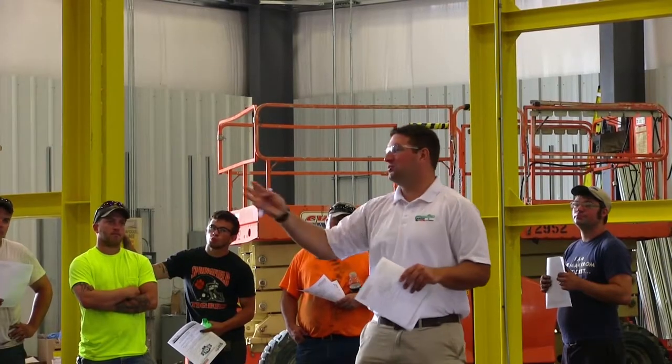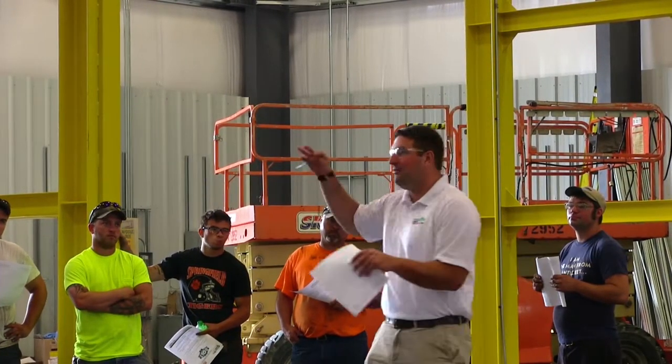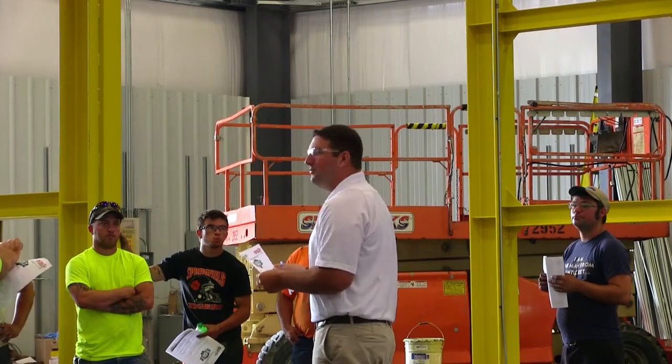But Ryan also told me that there's a bunch of things that need to happen before the installers even get to your facility. The installers want to go to the site and see what they've got to work with, what obstacles they've got to work around, meet with the customers, see where they're going to stage their product when it arrives, what kind of equipment they need, how they're going to get into the facility, how big the overhead doors are, if there are pits in the floor, if there's equipment, machines, or conveyor belts that need to be moved around. You need to cover all this with the point of contact so they know what they can do to prep before you arrive and make it smooth.